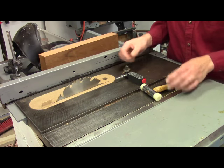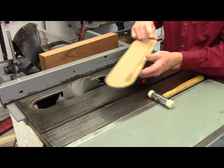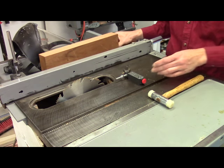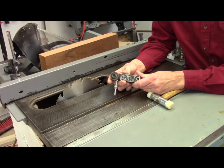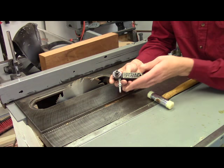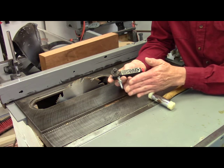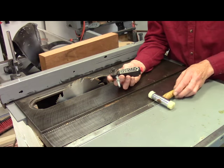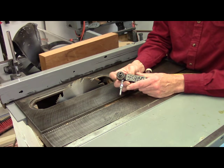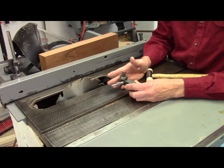This is not something I've come up with — I've just adapted a tool in a way I've not seen anybody else do. At the heart of it is this tool called a Mighty Mag. It's a machinist's tool: a powerful magnet built into a base with various holes drilled in it that you can bolt things to. In this case, I have bolted a thrust bearing from a bandsaw to it. I found it fits perfectly on the stud there, and that will be the bearing point to come up against the block so we get a consistent thickness strip.